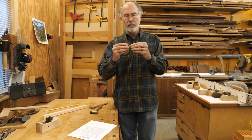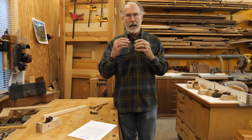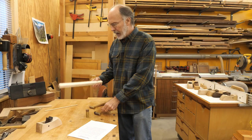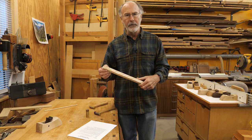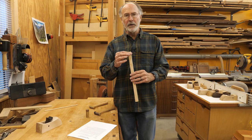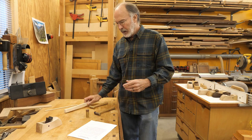Because I don't just want to glue the brass directly to the wood, I'm going to drill a hole in each end and put a small piece of dowel in there just to provide a little extra strength. I've never had that come loose yet. The handle is either white oak or ash — I've got ash in this case. Ash is a very strong wood, typically used to make baseball bats, so it can take a lot of impact. You want a fairly straight grain piece, and this is 4/4 material, roughly an inch thick and maybe 7/8 wide.